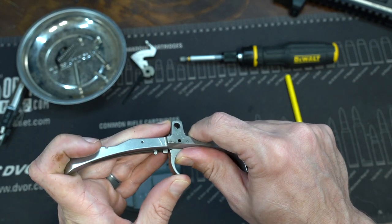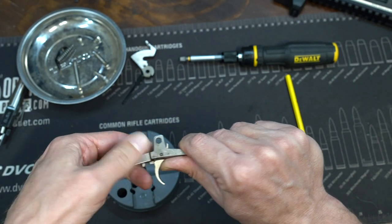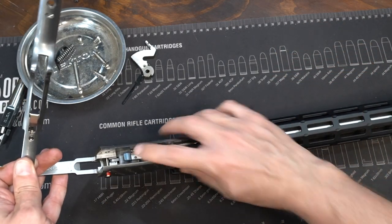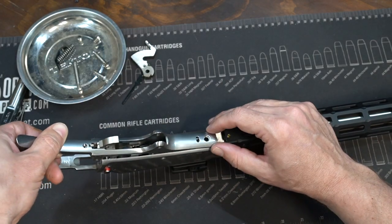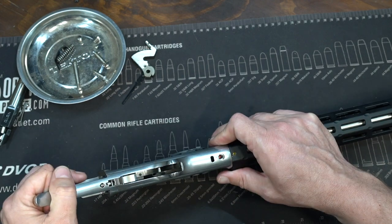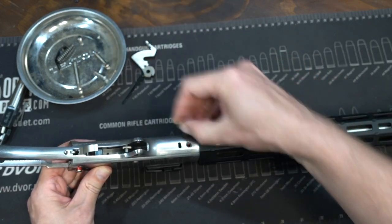That's going to give you your tension. Push up so that the holes align and just slide your pin back in. Assuming your locking block didn't slide or do anything weird on you, it is as simple to put back together as it was to take apart. Make sure that all your holes are aligned and reinsert your screws — remember the longer one goes in the bottom and the shorter one goes in the side.